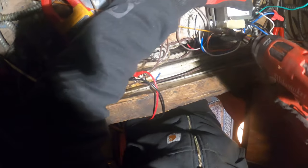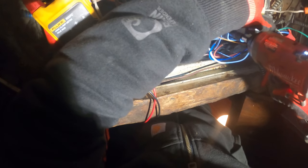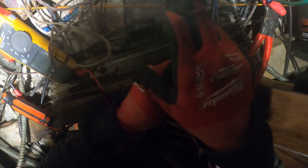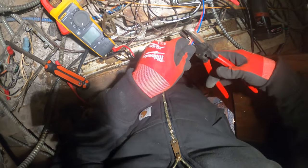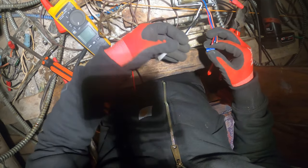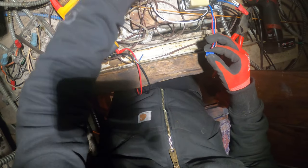Alright, so here's our primary and here's our secondary — this is just 24 volts, but we have a bunch of wires here. We're using 120, so the common is white and 120 is black. These three other wires I'm just going to cut them and cap them with small wire nuts — or tape them off so we don't have any feedback. So let's get rid of these, and then this is all we're going to use for our 120, and here of course is our 24.